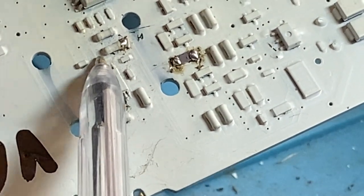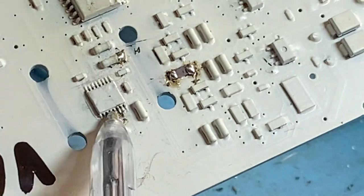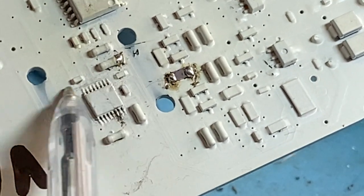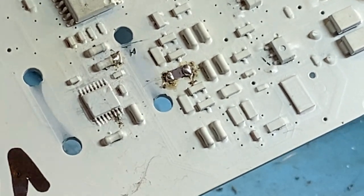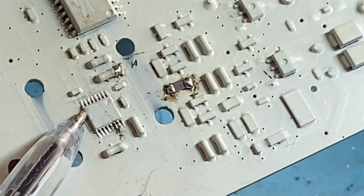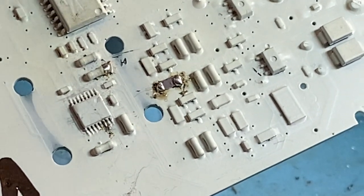If they are not totally blobbed with solder, and you've cleaned them up and got solder on every pin and both sides are hot, you'll flick this up and it'll rip the tracks off, right? And that is a major disaster, because everything is so fine, and trying to reattach little tiny wires and things. If you do that, your detector's very close to being a write-off.